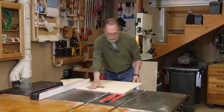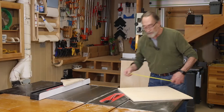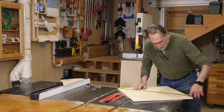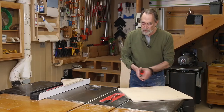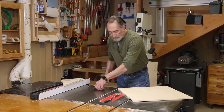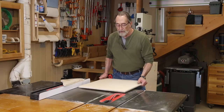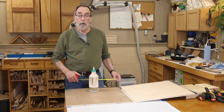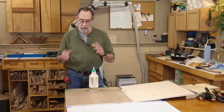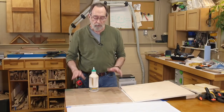I have one pretty decent looking piece of plywood, but I'm actually going to need four of these. Just making sure we didn't create a parallelogram — I didn't want it to be out of square. So now this is oversized but it's square, all the edges are good. I'm going to use the other pieces and make three more just like this. I've now got four panels prepared: they are 21 and a half by 21 and a half, so they need to be trimmed down to the final 21 and a quarter.